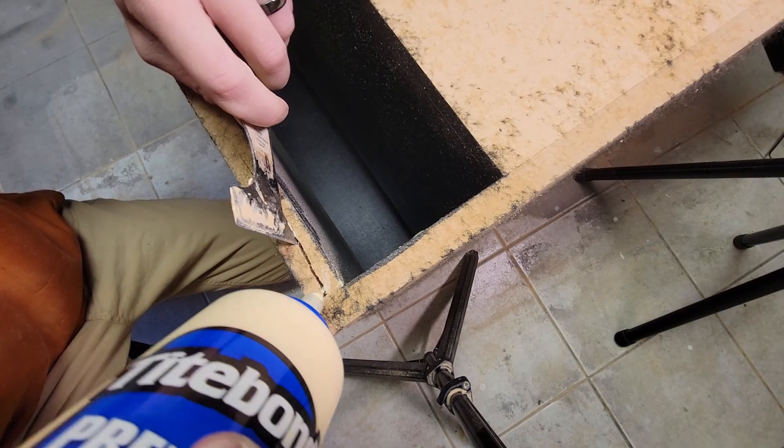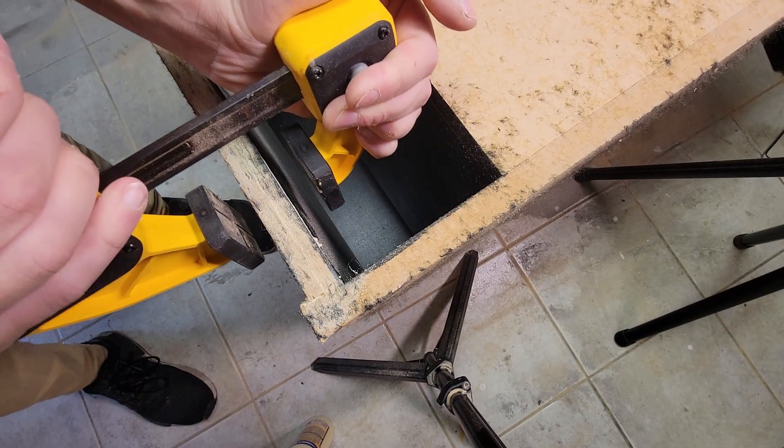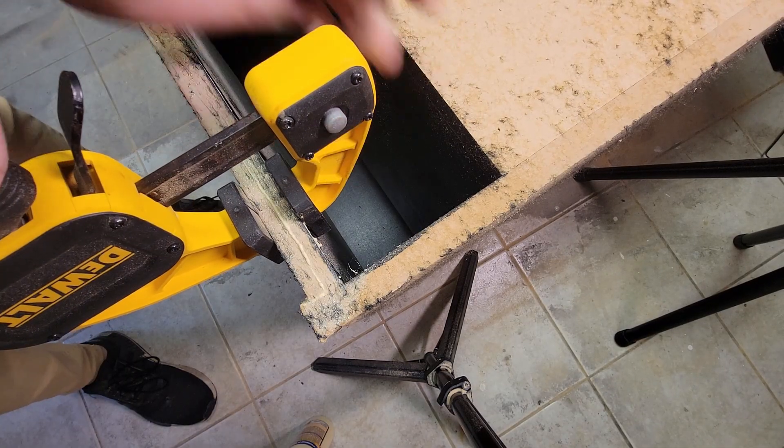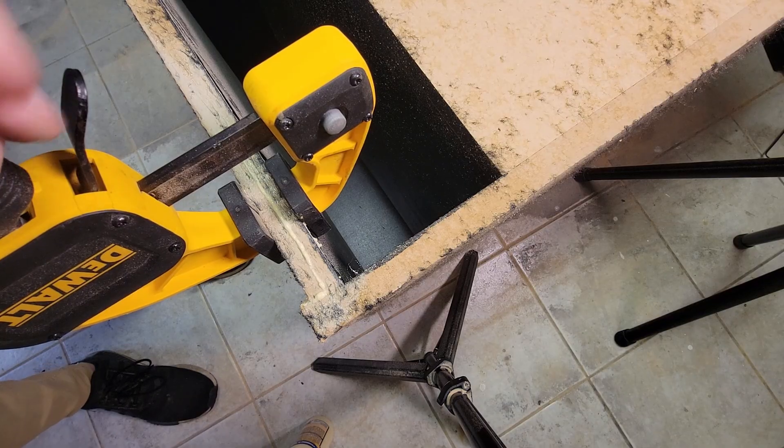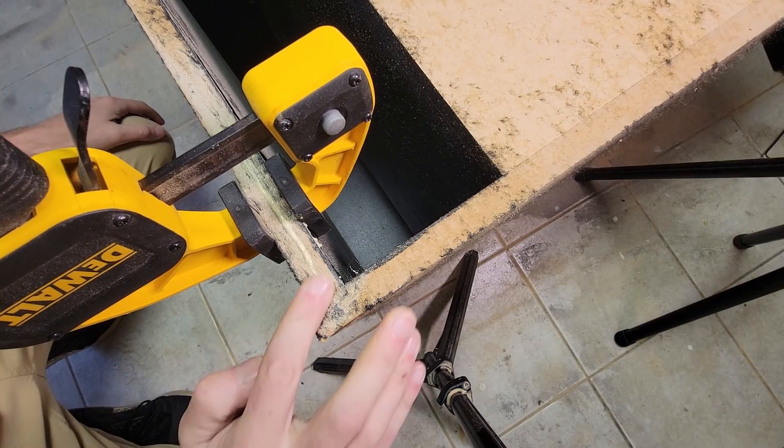This enclosure was built using glue and screws — this is done in car audio to provide better strength as it will likely take much more abuse from driving around with it. As a result we see one of the screws has caused a split in the grain of the port wall. This is a simple fix; we'll glue and clamp this.